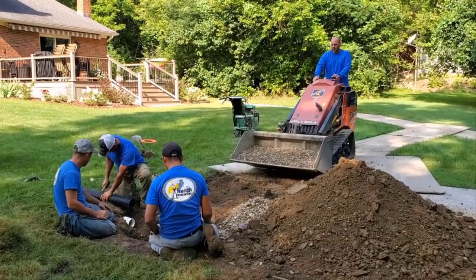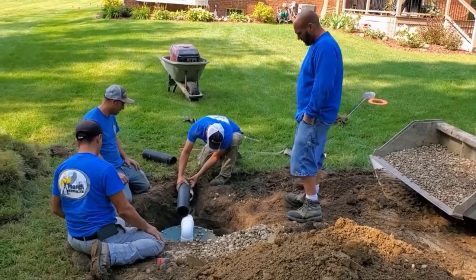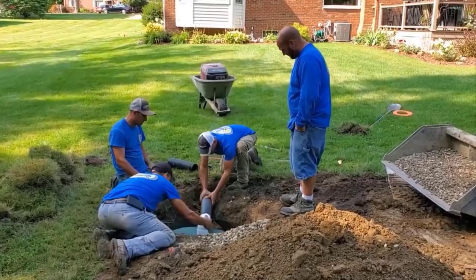We're going to have a lot of stone. We're going to dig out a lot of clay, and then we're going to cover this leach field with straw, so you're going to see that. So the sump line just drops into this vertical drop, and then there's going to be 5 fingers that come off this. So when that can't keep up with the homeowner's sump pump discharge line, then the leach field takes in the rest of the water, anything that's considered an overflow.